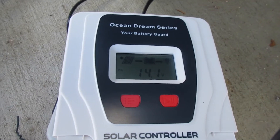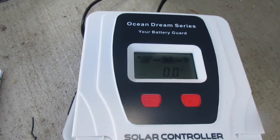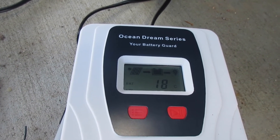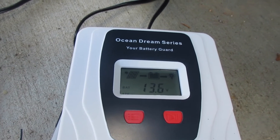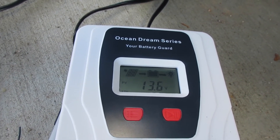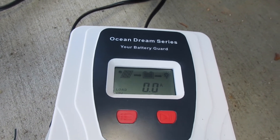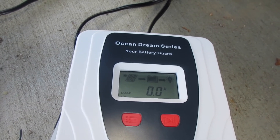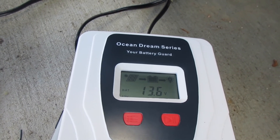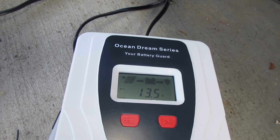The PV is your solar putting out 7 amps now — we've got lots of good sunlight. The load is zero. Temperature is 18 degrees Celsius. And we're charging at 13.5 volts — that's what our battery is actually at. We're charging, so we have six amps going in and we're charging at the PV rate from the solar, which is 13.5. This is really awesome.